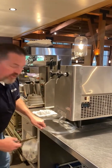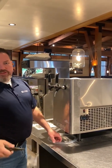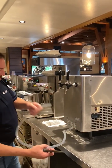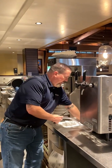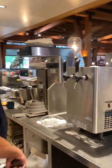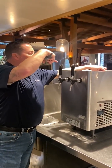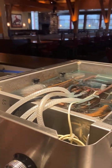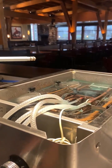Now I'm going to drain the water bath. I put a capful of bleach in the bath and let it circulate for about 15 minutes to help clean the existing bath. The drain line is coiled up underneath — this is the condensate or drain line for draining the water bath. Uncoil it and put it into the sink. If the sink's not close by, you can use a five-gallon bucket. Here in the top of the water bath there's a white pipe stem connected to the drain line. Using a pair of needle nose pliers, pull it straight up — that will allow water to flow out the drain line.